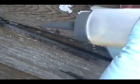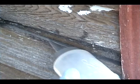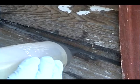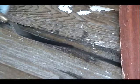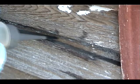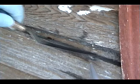Then I'll apply an epoxy consolidant or primer to both surfaces. I'll just dribble a little on with my narrow spouted bottle, and then spread it out with an artist palette knife. I'm being careful not to get any on the clapboard underneath because I don't want to end up gluing this clapboard to the one underneath it.